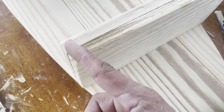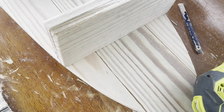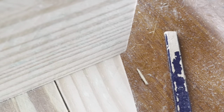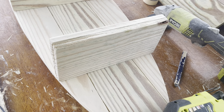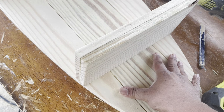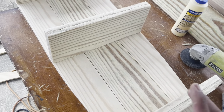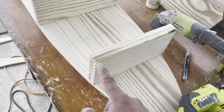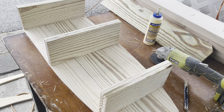On the bottom of the shelf that point is flush, but up top it extends out a bit. Because I have my miter saw here, I'm just going to put a light bevel on that end — just a degree or two. We could also do it with our orbital sander once it's mounted. We also need to put a temporary cleat on here to hold these three back pieces together — one up top, one in the middle, one down here — so we can mount our shelves. I'll put the bevel on, put the cleats on the back pieces, and then we'll talk about mounting our shelves.